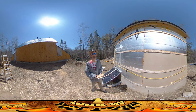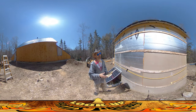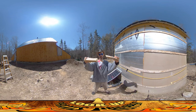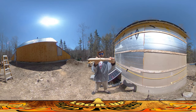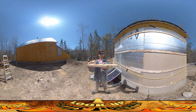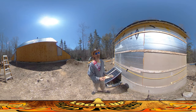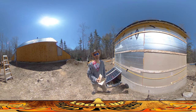I always start at the corners and work my way across the structure. I realized before I recorded this video I actually did it a little backwards — in fact completely backwards. When you're designing shiplap wall boards, they lay over like that, and whatever your primary wind direction is, you want the gaps to be kind of opposite it. If the wind is coming from this direction, you don't want to lay them this way because it'll drive rain into your crack. You want it the other way so moisture gets shed across the crack. I accidentally did it the opposite way, starting at this corner and running them in that direction.